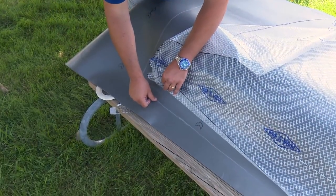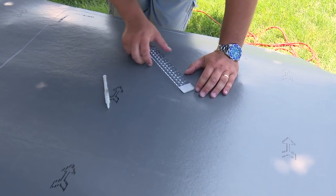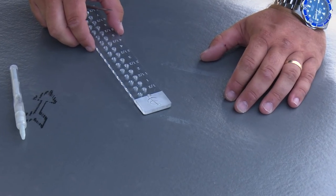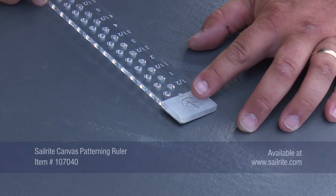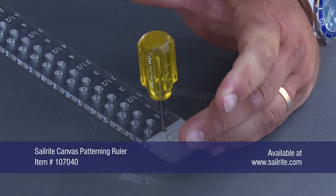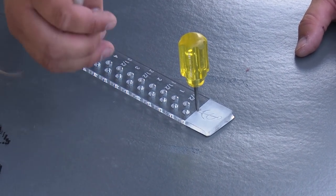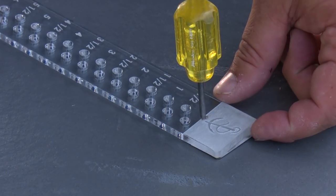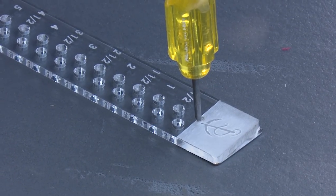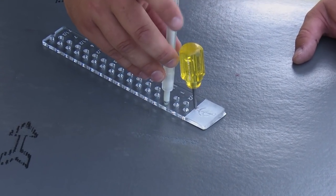Now the pattern material can be removed. The basting tape is a little bit too aggressive. Our hole for the table is 2 inches in diameter and we have marked the center. We are going to use our guide — at the 1-inch mark that will give us our 2-inch diameter circle, which is the inner circle to cut out. But we do want to enlarge it slightly to give ourselves more flexibility, so we are going to increase that to 1¼ inches, which will give us a 2½-inch diameter circle.